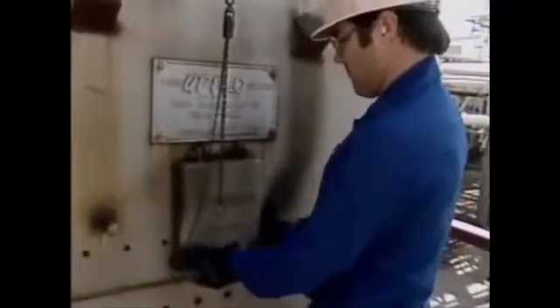During the start-up preparations, all access openings should be closed up tight. These include all the peepholes, doors that provide access for tube headers, and any other places that could allow air leakage into the furnace during operation. If you spot a potential air leak, report it.